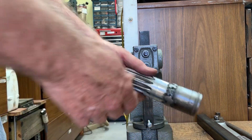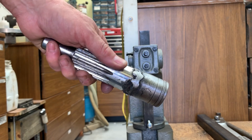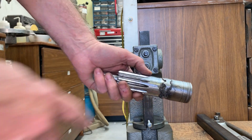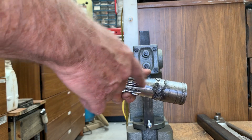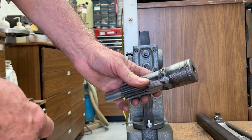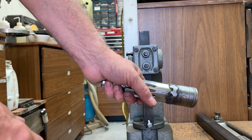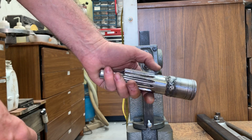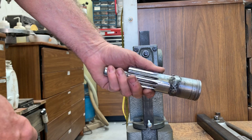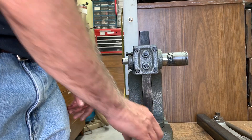I had a spare socket — that's an inch and a sixteenth socket — so I cut off the part of the shaft that had the hole in it for the bar, and turned it down so it was a snug fit on the inside of the socket. Then I machined a V into it so it would weld better. Not the world's best welder, but this looks like it's strong enough so far.